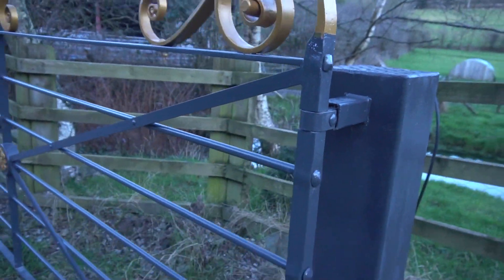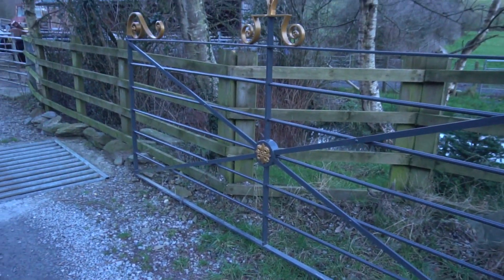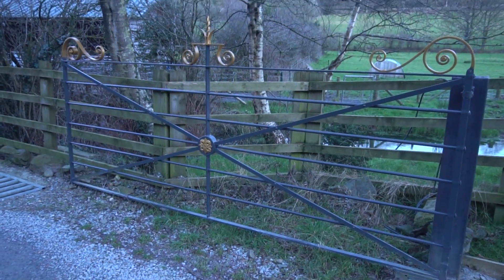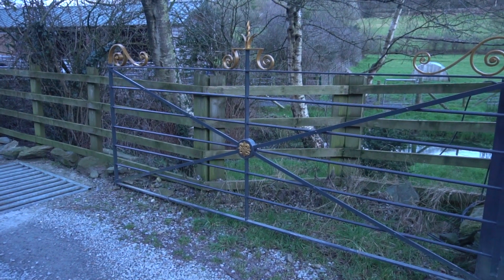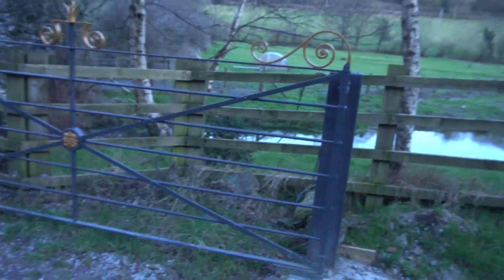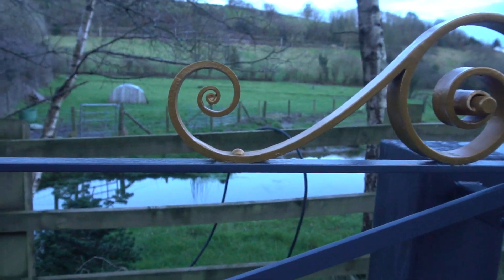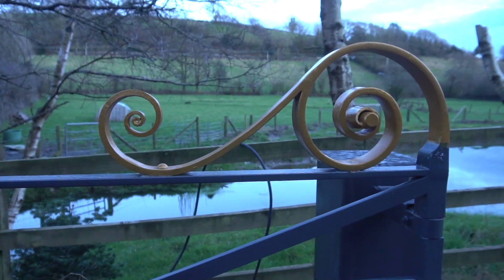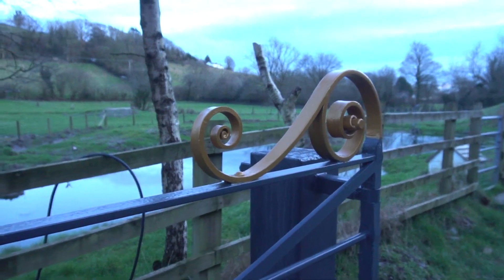Now these are nicely triangulated — this is a good gate showing you that triangulation. These diagonal crossbars prevent the gate from sagging. This gate is about four metres wide, so it's a fair old size, and without those diagonal braces it would just drag on the floor and wouldn't function. The scrolls also help with the triangulation — they may be artistic but there's a rivet just here that's helping to brace that corner and prevent it from dropping as well. All that scroll work you see on the old gates does serve a function.